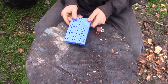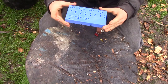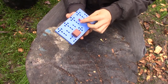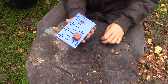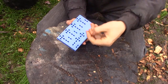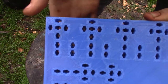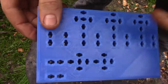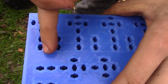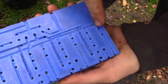I have 3D printed this part that will support the electrical system for my tractor. It will support the relays and the fuses that will fit into these holes. To do this I will have to put blade connectors into the holes. The round holes aren't wide enough for the tail of these connectors, so I will have to make them bigger by hand with a hand drill. I've printed thick walls so that I can modify this part.